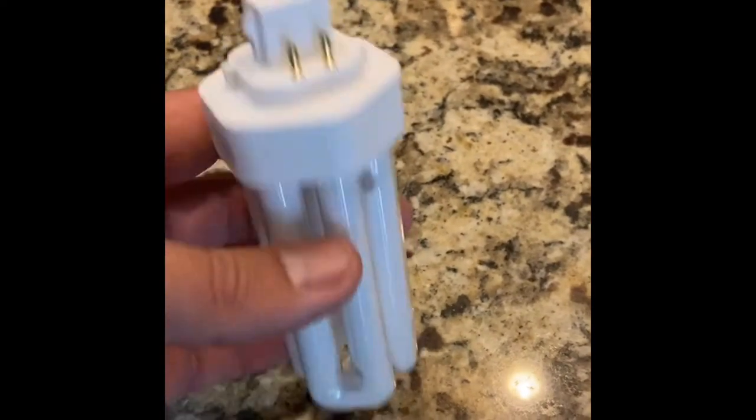So at the moment, it's my kitchen, and I got like three different colors of lights going on here just because that's all we could find at the time. That one there in the middle has got a bad ballast, so a new bulb's not going to fix it. That one over there is burned out, and it was just replaced like a year and a half ago, so that's kind of frustrating.